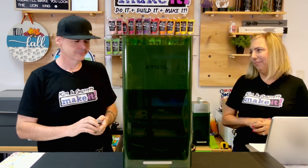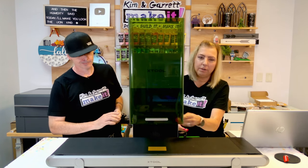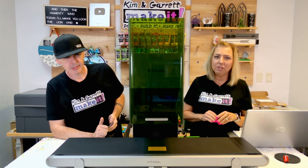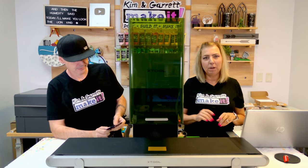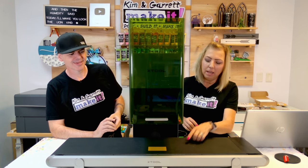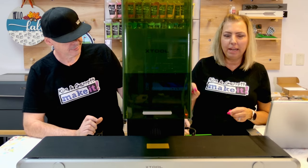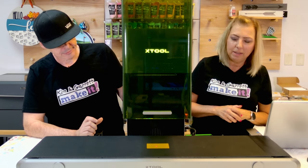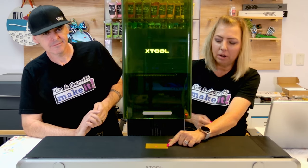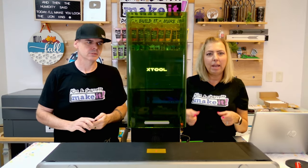All right, the first thing we're gonna do is put one down on our conveyor system, which I have here. Now, when I tested this originally, I couldn't get the conveyor system to work, and I learned what my problem was, so I'm gonna share my little trick with you. When you place your business card under the red light when you do your sizing, he's turned it on so you probably can't see it from there. If you place the business card under the red light and scan the image, the machine is now looking for that object.